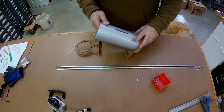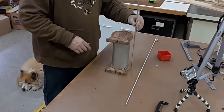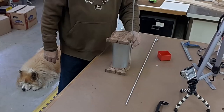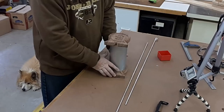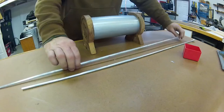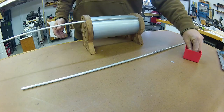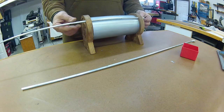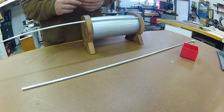At this stage of the game, the last piece of this puzzle is to cut and thread four rods that are going to go in here like this. I've got enough rod here to come oversized and still have plenty, but because these nuts have a limited depth, I'm going to have to be pretty close. I can over-thread them since I can thread them in farther on the ends — they just can't be over length.